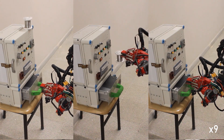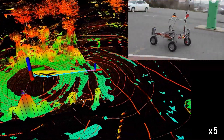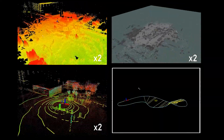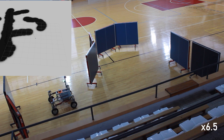We developed each of our systems by repeatedly testing them in simulation and performing drill missions in real life. The steering system is configured for autonomous navigation and teleoperation. With the SLAM algorithm, a cost map is obtained using the 3D map constructed from accumulated point cloud data. While orientation of the rover is consolidated by two IMUs, localization is improved using one GPS at the base station and another on the rover. By adding plugins and customizing the navigation stack, the autonomous movement is stabilized.